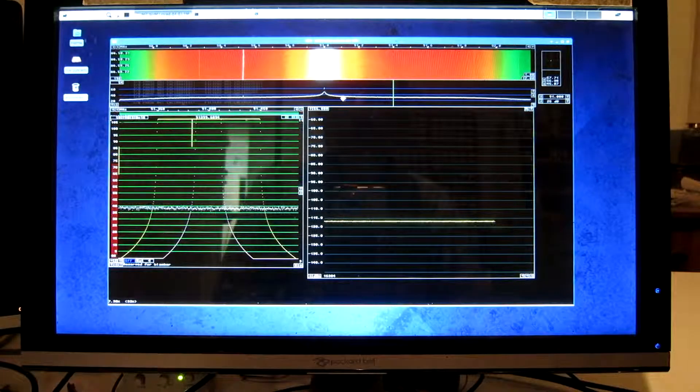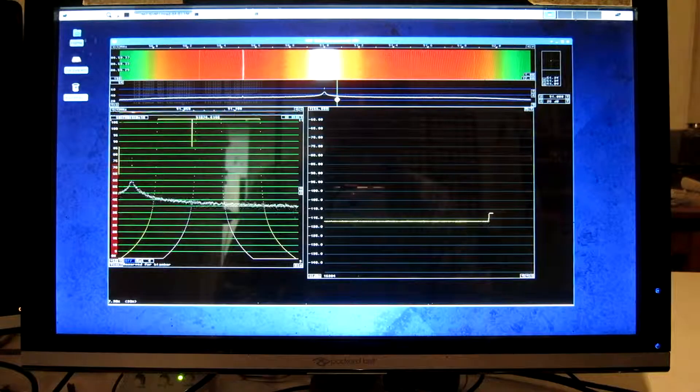You can also see that the noise floor is not absolutely flat. If I click here near the center I get much more noise — the noise figure is not so good here. So the calibration on the level is probably reasonably accurate.